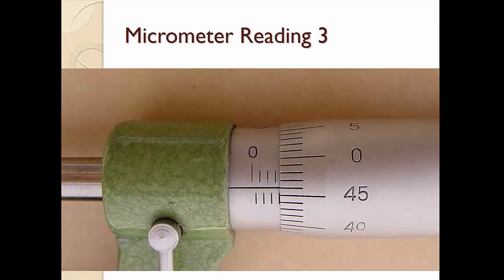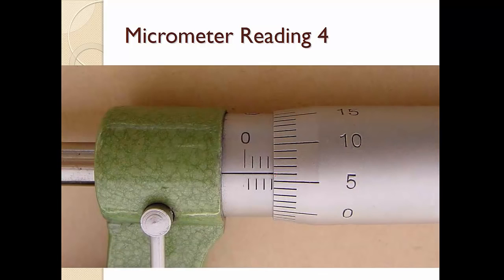It is something very similar. This 0, 1, 2, 3. Even though this line is peeking out, again it is a number very close to 3.5, and in this case it's actually just 3 plus 0.46. Okay, this number is 46, so this is 3.46, which is very close to 3.50 mm. Okay, so this is then a number that, you use 3.5. Again 3.5. Okay, how do I know that it's actually 3.5?